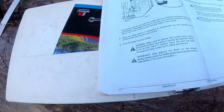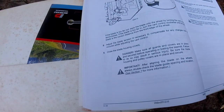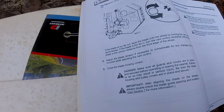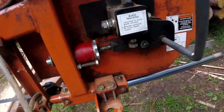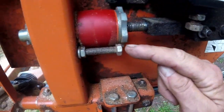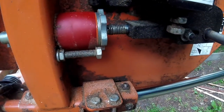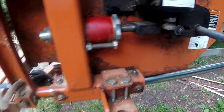After doing the tracking, I'm supposed to recheck the blade tension. The end of this bolt should be flush with this washer. It still is — it hasn't changed any. Should be good there.